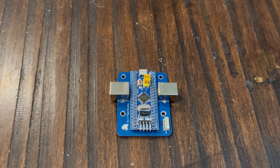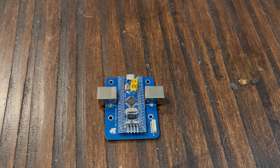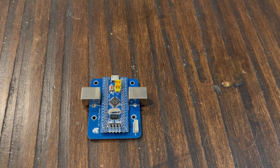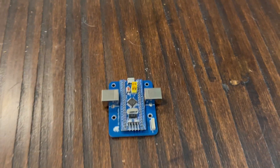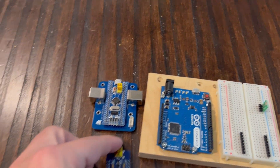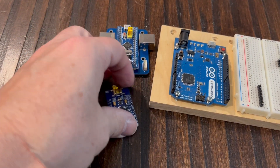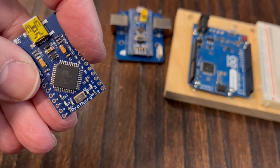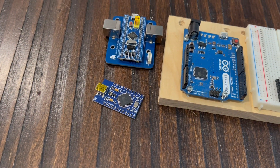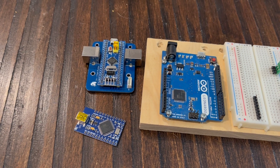This is the microcontroller board that shipped with the Falcon S1 pedals. It's an STM32F103 — it's a $4 part on eBay, basically. I don't have any experience programming this particular chip, but I do have a lot of experience with the Arduino Leonardo, and this is the one I intend to use. It's a 32U4 chip, the same chip used in the Leonardo. It's not nearly as powerful as the STM32, but it does have native USB hosting, and that's what I've been planning on doing anyway.